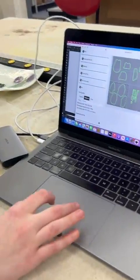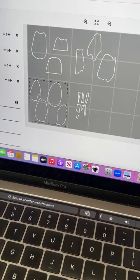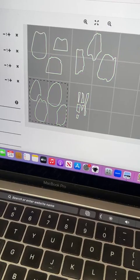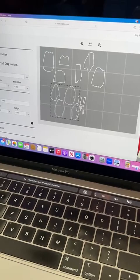Daisy was pointing out that we're using a very specific file type. We're looking for an SVG file or a DXF file, and if that's not something you're capable of doing, we certainly can do that for you — we can convert a file to the appropriate thing. The software for the Wazer requires a very specific file type. This is the actual software we use — it's called WAM — and this is how we convert a file to specifically what the Wazer can cut. It gives us lots of options: we can scale in here, we can duplicate an image, and we can say where on the cutting bed we're going to cut.